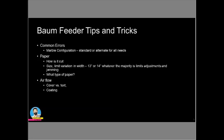And you want to make sure that it's just touching, not feeling resistance and not a huge gap, just touching when you slide it underneath. Otherwise, you may need to lower and bring it up or down. Now, I also recommend that you lower the paper feed, bring it back up, check it, and lower it again and bring it back up and check it again.